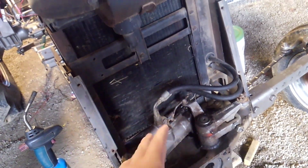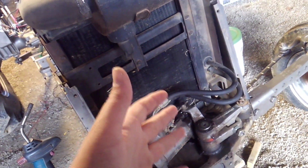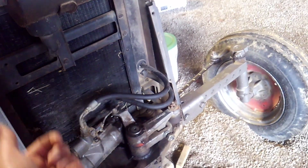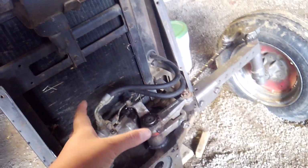My right tie rod kept coming loose, and we fixed that. And this steering, it's still got a little play in it, and we've adjusted it and redone some things to make it a lot tighter. And this shaft that we bought, we paid $340 for that shaft, the steering shaft. Well, the original one had a grease zerk, which was drilled down, and then had 2 spigots coming out in the center down there where the shims are. Well, we bought this shaft, and it didn't have that, so I just kept oiling it through the year, trying to get through the year so we could maybe try and fix it, or have one of our local machine shops drill it and do it like it's supposed to be.